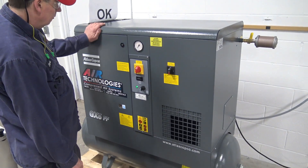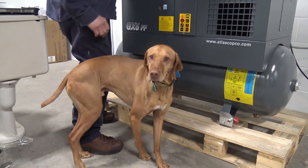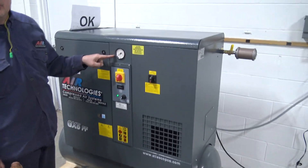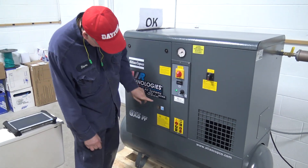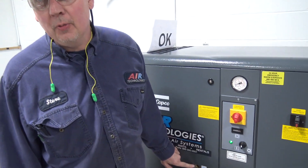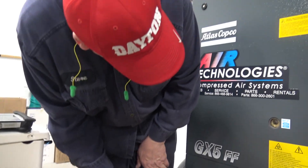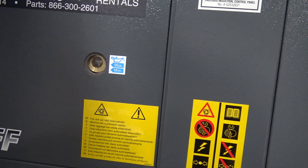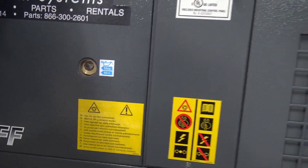There we go — it's running. It's that quiet, folks. The muffler was closed — the ball valve was closed — so it fills the tank up. Check the oil level when it's off after a few minutes so it can settle. Some new oil drains out of the filter and out of the oil cooler. It drops quite a ways once it's running, but when you shut it off it'll rise because the filter and cooler will drain back to the sump.